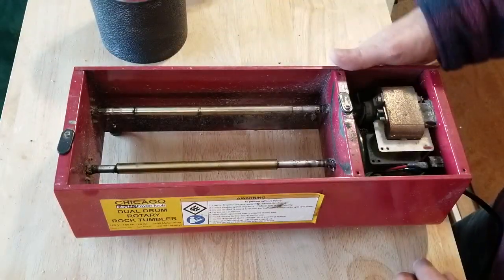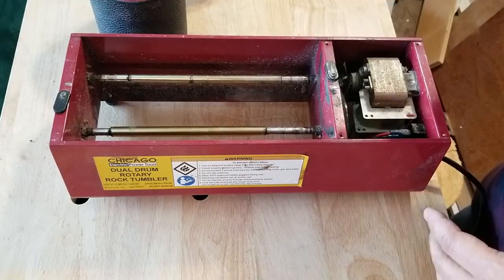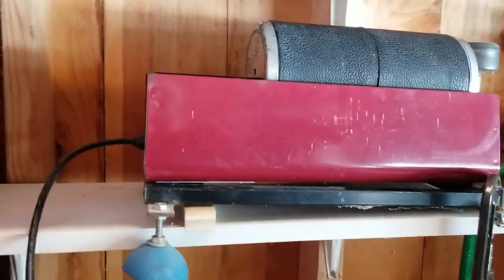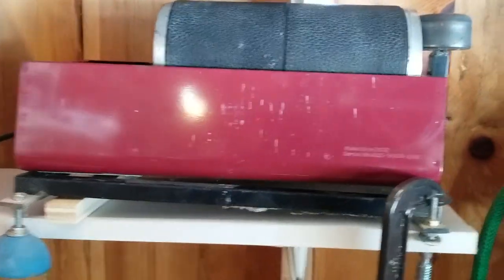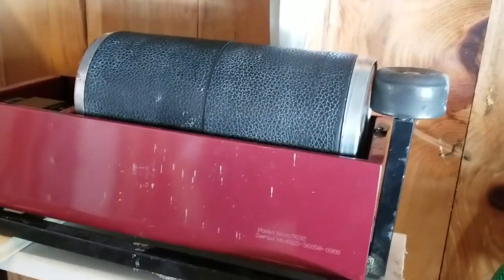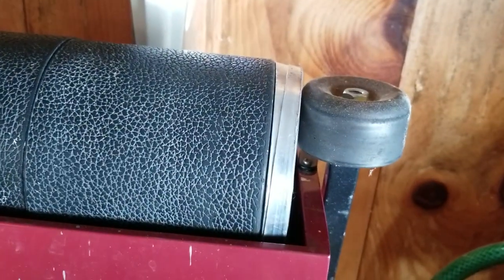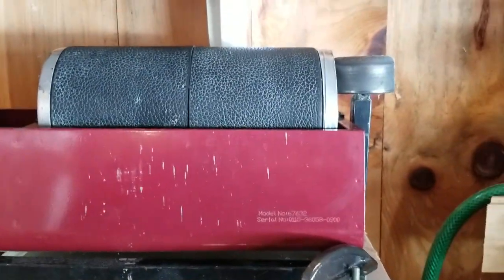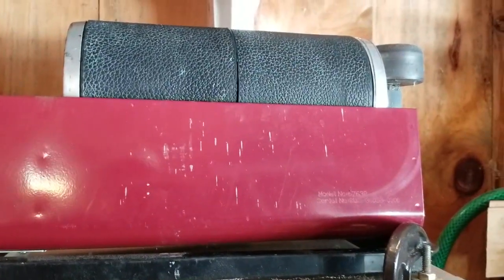If you make it perfectly level and put a steel ball in here, it'll end up running off. So one thing you do is make a wooden frame, have it slightly tilted, and have it run up against a running wheel. This is a steel frame — you can use wood, scrap wood, 2x4s, or whatever. It basically just uses a roller skating wheel right up here. As things turn, the tumbler migrates this direction and just rolls on the ball-bearing skateboard wheel. The wheels are super cheap and it ends up all tilted so it rides on that — pretty friction-free.